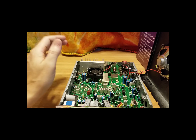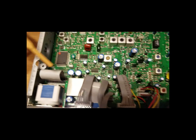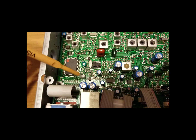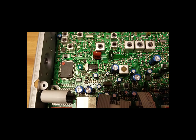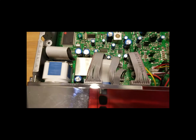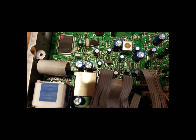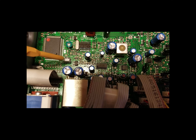Taking a look inside the radio: on my version there are two jumpers, a channel selector, and a ribbon cable. There are two sets of jumpers — putting it on the front set was the CB radio conversion, then set it on band D. Here's a peek at the board: the speaker side is next to two electrolytic capacitors. The back set versus the front set — the front set is where you need to be if you want to talk on 11 meters.